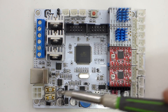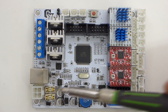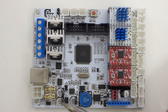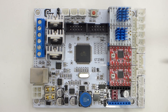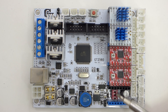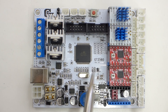We have USB, power, and two very small fuses — a 15 amp for the bed and a 10 amp for the extruder heater. My first board had bad fuses, so I ended up returning it and getting another one. I actually bought replacement fuses which made this board work. And just as you can see, underneath one driver there are three jumpers — this is how you change your microstepping steps, and there's a chart right on the board showing how to configure that.